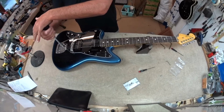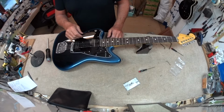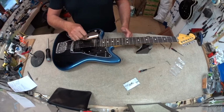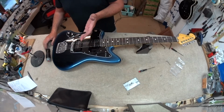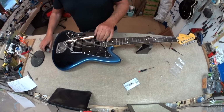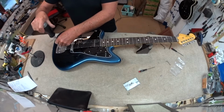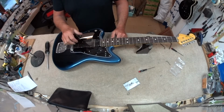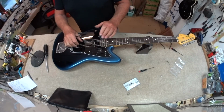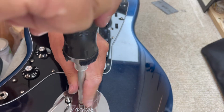So if we slack it off a bit more and we go to the point where we're getting a click from rest, bending it back gets a click, but we don't really mind that. But any more in this direction, you see it starts to bend the pitch up, and it also starts to thrum. So we definitely want to tighten it up until there's no pitch rising at all when you pull back. So still some there. Remember, this is only in the lock position.